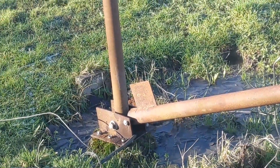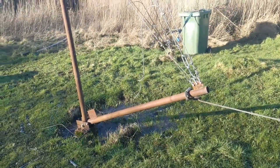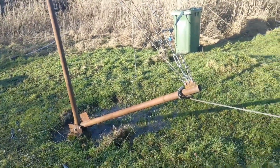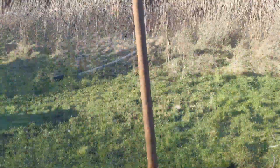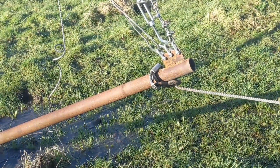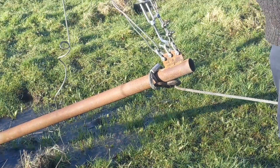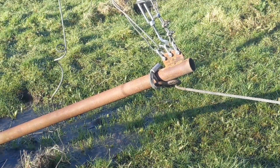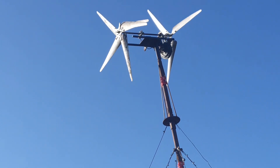I've had a bit of a mess around with the gin pole and it's at a bit of a weird angle. I don't know how well that's going to fly. But what that means is because I've raised that end up off the ground more, it means the tower actually comes more level — whereas before it was stopping too low, not pulling it up vertically. I'll change that. It does mean it's a lot easier, but I've got to mess around with all the cables whenever I want to take it down.